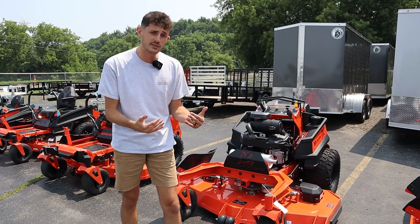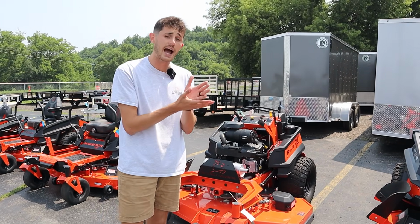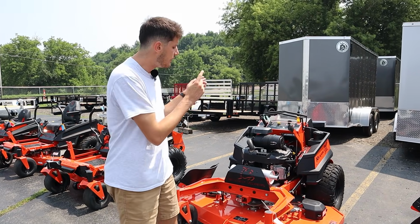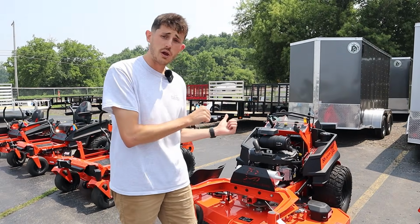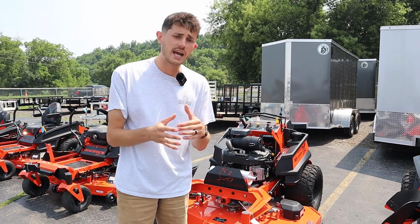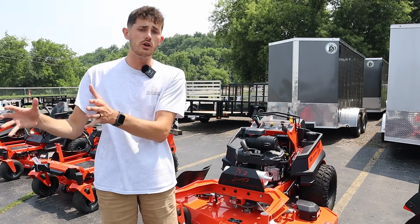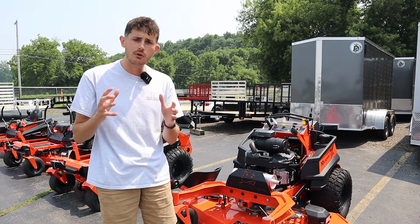As for the transmissions, they're similar to what you find on the Rogue. The Rogue's gonna have 16cc hydro gear wheel pumps and 18 CI Parker wheel motors. The Revolt X is gonna have those same 16cc hydro gear wheel pumps, but they're also giving you 18 CI hydro gear wheel motors. So they're enclosed on the back here, and we can take a look at kind of how those are set up.